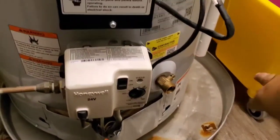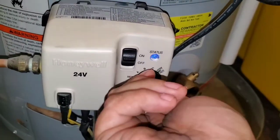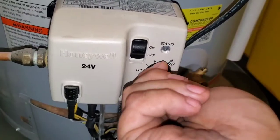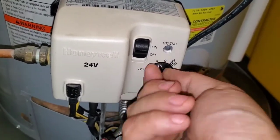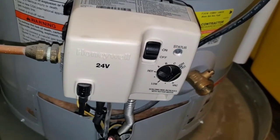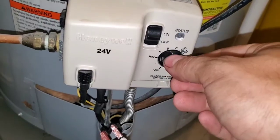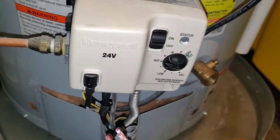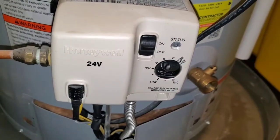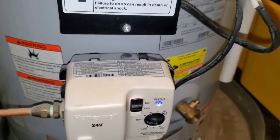This is very fast — you have to do this immediately after you plug it back in. Cycle the dial: very hot, low, very hot, low, very hot, low. I just heard a click. Now set it to the normal setting — 'hot' — and that's it.